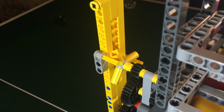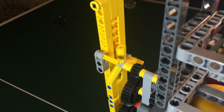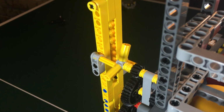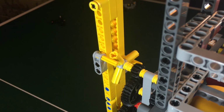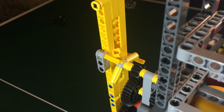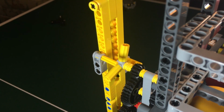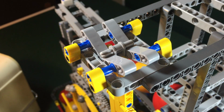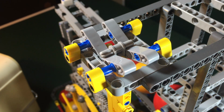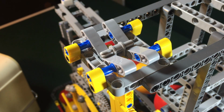After much fine-tuning, I discovered that the ideal striking point sat right on the Lego grid, and it meant I could fit this extremely simple pair of bars instead. Once set in motion, it is proving extremely reliable, so long as the motive power of the balls is sufficient. The pendulum itself swings on a single Lego axle rod that lies in a shallow V. A knife edge would have been better, but I lacked the necessary Lego parts, and this worked for this stage of development.